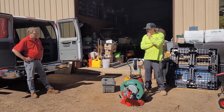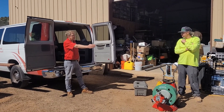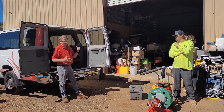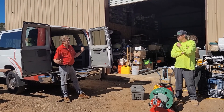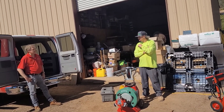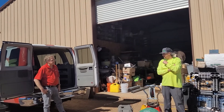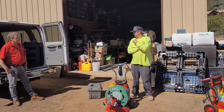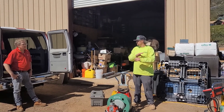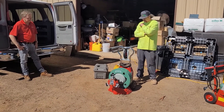Probably the most all-around blade that most guys use is the two inch. Your cable is going like this, so it's covering a bigger path. When you get those big blades in there and they catch on something, the machine's going to come to a stop, or it's going to snap the cable. I would rather make you do two trips down that drain than go down with too big a blade and break it so you have to dig the pipe up. The good thing is if you can pop the hole with a small blade, you can send the camera down and see what's going on. If you've got a fitting that's off or something, and you put a bigger blade in there, it's either going to do damage or get stuck.